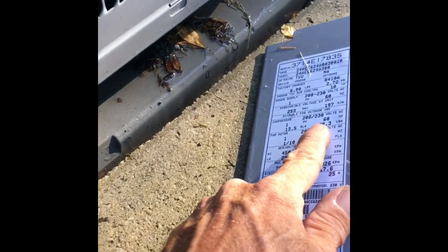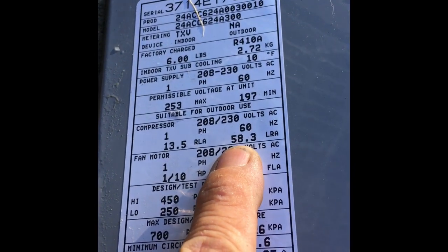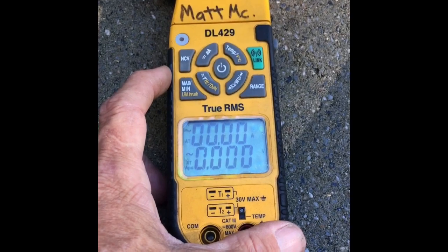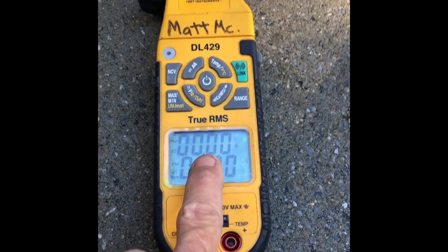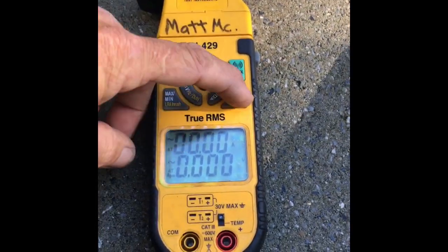Obviously we want to look up in our little box over here — we'll see what we should be looking at: 58.3 locked rotor amps. If that number is three digits, you expect it to come in at three digits. I change the range on my amps for the UEI — every meter is probably a little different — but I've got two decimals there.